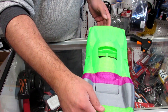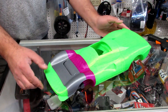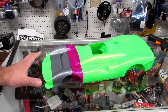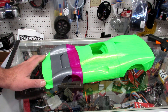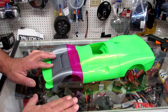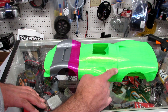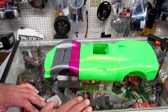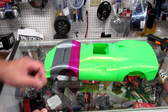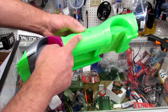And there we have our car — kind of ready. This is the 1/10 scale Ferrari model with all the details of the real car. What I'm gonna do with this is make a mold — first sand everything down smooth as much as possible, shoot automotive primer on it, and close the gap between the two prints on the back. What's cool about this project is that I took a file from the computer and made it into a 3D print that ended up really nice.